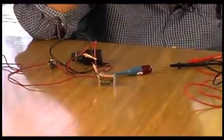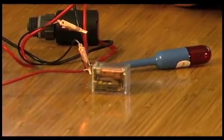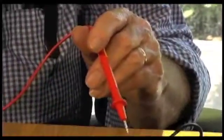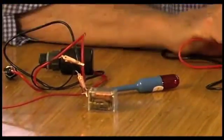The main advantages are speed. If you look at this little relay here — it's an ice cube relay. These are used throughout industry, and the example I have here is with elevators. There may be 50 or 100 of these in one elevator, and when you open the panel to test it, it's just thousands of wires to check. If you do it with a voltmeter, how would you find the correct wire behind it? You have to go to a schematic and find out wire number so-and-so on such-and-such a relay — you can see all the little contacts behind here. You take the voltmeter and measure the voltage, and you read a voltage if you get that far.